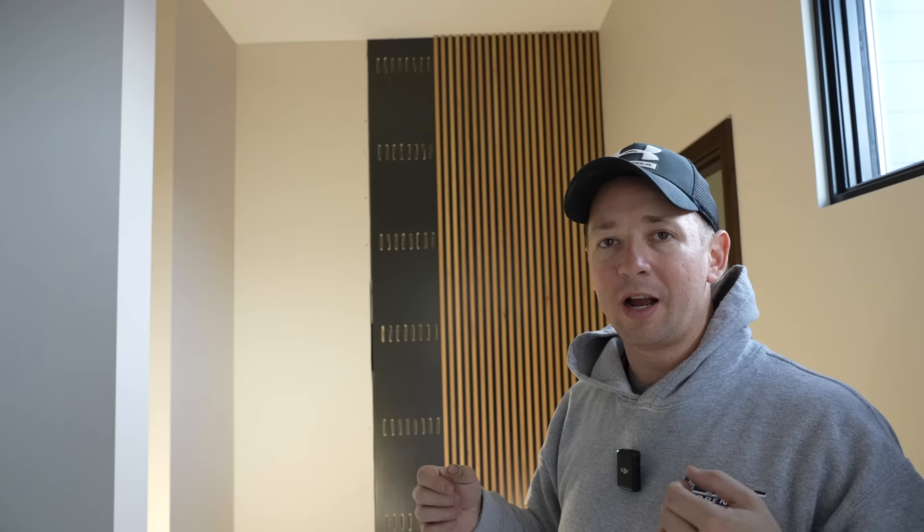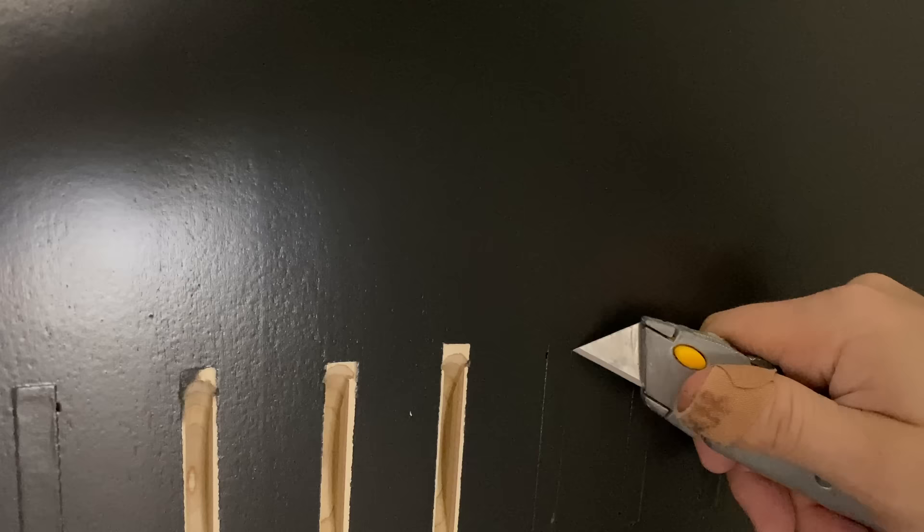So I bought some three-eighths-inch-wide tape — half inch would have been better — and covered all of those slots so the paint did not get inside them. Then I popped all those pieces of tape off and got on to the process of putting the slats in. I'm really happy with how the progress is turning out — everything is going together very crisply, the margins are fantastic. Even when slats are crooked with some bow, the Tenso connectors spaced every 18 inches are straightening the pieces out and keeping a nice three-quarter-inch reveal.